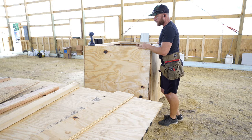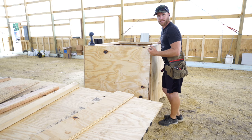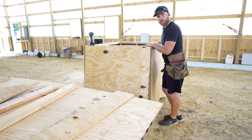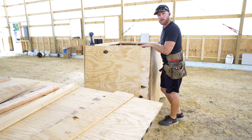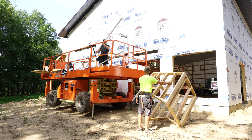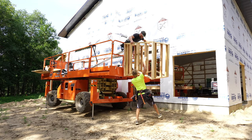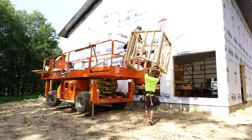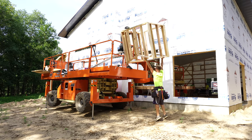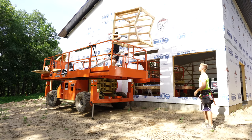We got our box made here for the chimney. Although I'm not going to go ahead and secure the plywood yet because I want to be able to manipulate the box to make sure it stays plumb, level, all that good stuff - if I nail on the sheathing it's going to be rock solid. So now we can take this up and get it mounted. No, we got this. My foot's caught. Just push it up. I'm maxed out, my calves don't want to go so high.